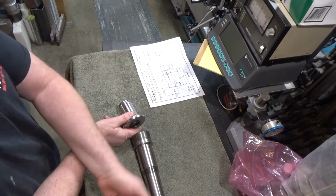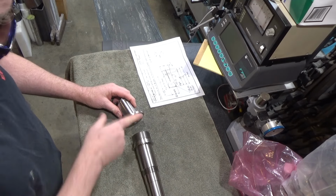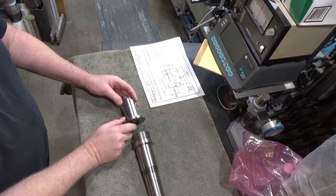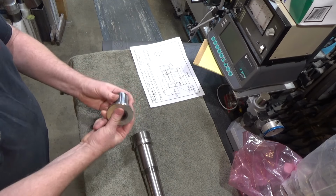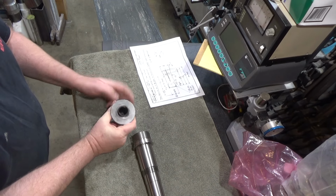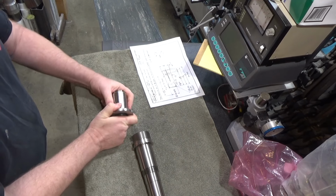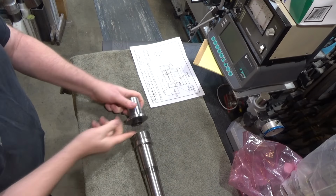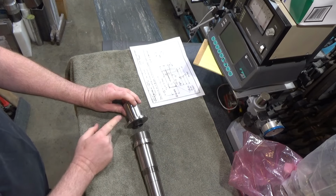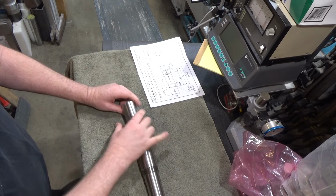It's got to push all the way through this whole section here and push the needle at the end out the back and the new needle in the next section as it pushes needles all the way through after they're welded. So this has to be smoother. I'm going to have to definitely smooth this up a little bit. Maybe remove a little material, some emery cloth in there, so that this is very smooth, because I don't want to have to use a lot of spring force, because when I squeeze these together, I don't want to have to squeeze and overcome friction plus.